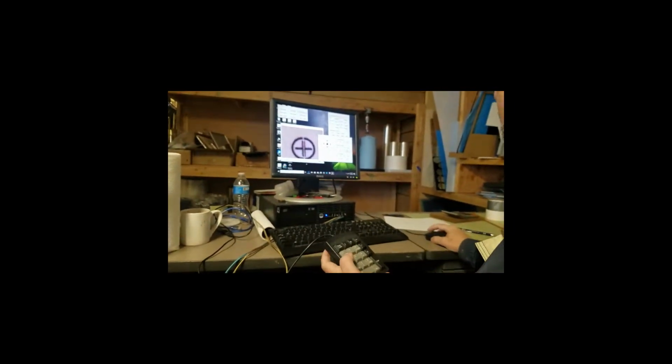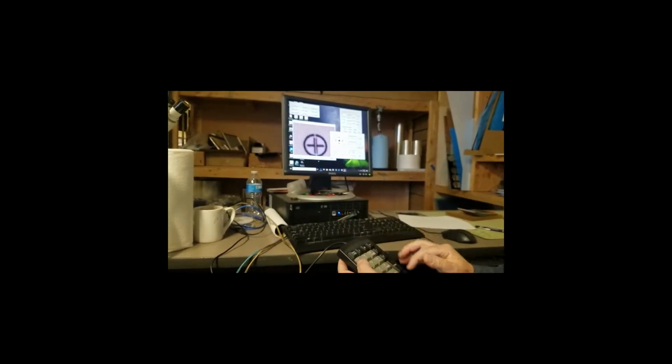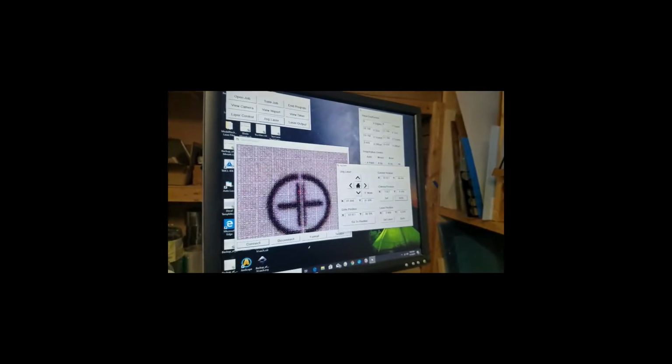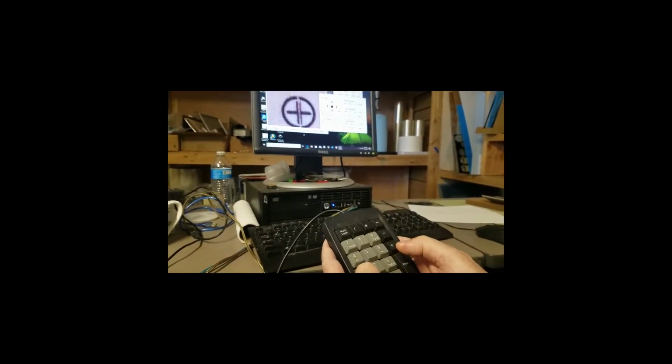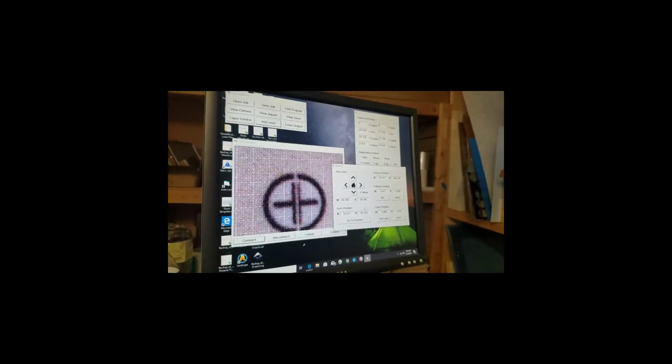So I'm going to jog. There's a jog control here, which is basically the arrow keys, but there's also the jog increment right here. It's preset to 1 inches. On the controls, if you use the home, the end, and the page down key, you can change those. I just went down to 1/1000th of an inch, and for this purpose I'm probably going to go to 5/1000th of an inch on both jogs right there. And now I can jog up.